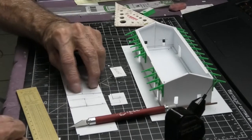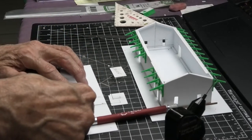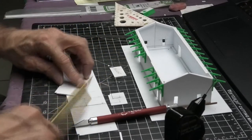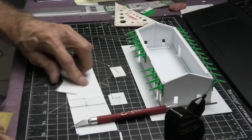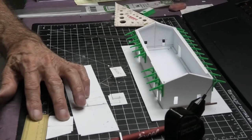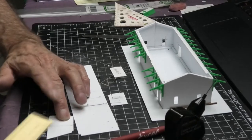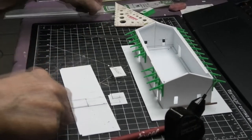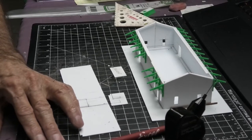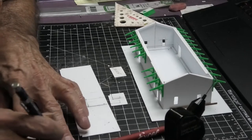All right, I'm going to put one more piece right here. And again, I'm going to leave room because the roof is going to drop in there also. Let's see. I think I made this 12 feet high. If we drop the roof down to 10 feet, we'd be okay. Right? So the roof is going to drop down to 10 feet. So what I'm doing, guys, is I am actually recessing the roof a bit, even though this is an inside deal. Inside the building, I'm still going to recess it, just because.